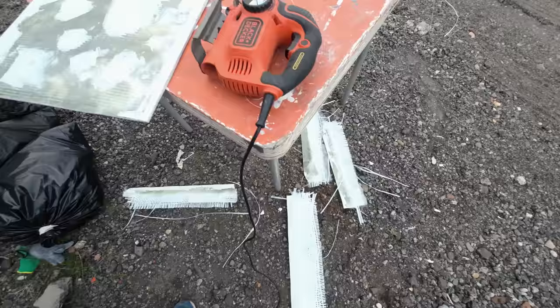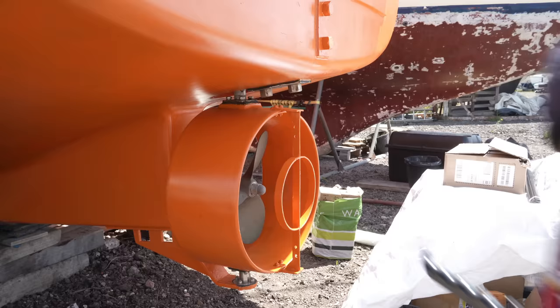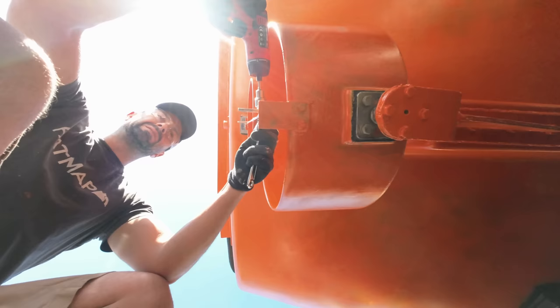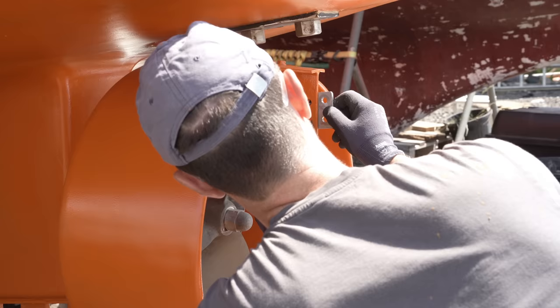Next, I prepped the steel mount, and I'm using the same steel system as before — thick solid steel and M10 bolts. I popped some sealant into the holes before I bolted the whole thing together, as although there's lots of primer, paint, and a couple of stainless fixings going on here, there are some holes through the steel bracket and rudder, and I don't want to provide a source for corrosion.